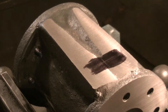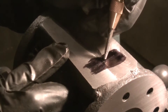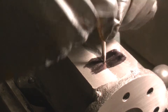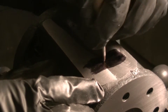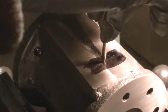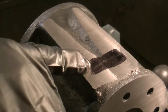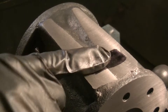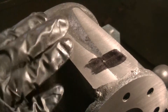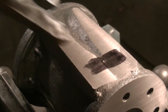I didn't lap this surface because there's no need to. On this side we're just going to make two half-inch by 13 blind holes and they're just going to have studs in them. The engine mount bracket — the bracket that holds the engine to whatever you want — will bolt to this surface. So this surface doesn't need to be lapped. We have our first hole there.